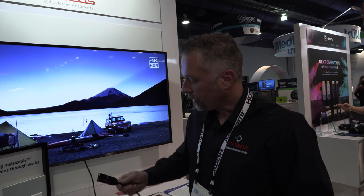Are you going to support HDMI 2.1 and even more bandwidth? Absolutely. Installers and integrators can put in a single optical fiber today for their 4K customers. When 8K is more prevalent and people are buying 8K TVs, you don't have to pull another cable through the wall — you just switch out the endpoints. Optical fiber for video purposes is essentially unlimited bandwidth. So you'll be ready even for HDMI 2.1 and beyond.